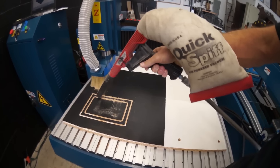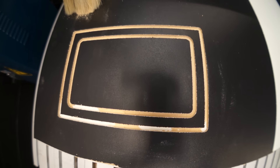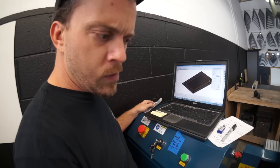Ten cup holders a day I used to average. I'll slip that thing in a customer's pocket and suck the money right out of his wallet while I'm showing him how to use the brand new stereo we just installed. So far this thing's cutting an accurate inner diameter and an accurate outer diameter — no tool marks on the edges, everything's as smooth as silk. But for some reason the depth isn't cutting deep enough. I measured the thickness of the material and went over by a little bit in the program, but the output is different from what I'm programming in. It cut through on the bottom but not quite on the top — we have to make it go a little deeper.